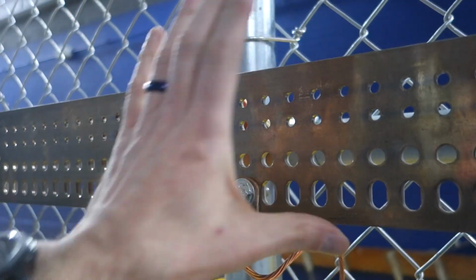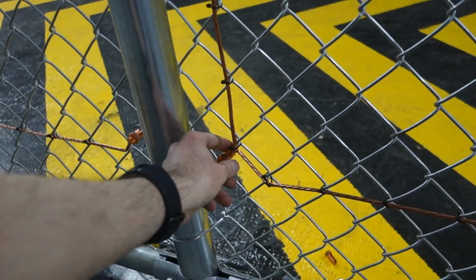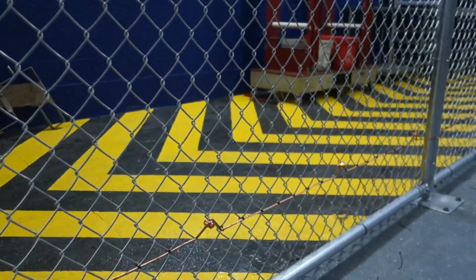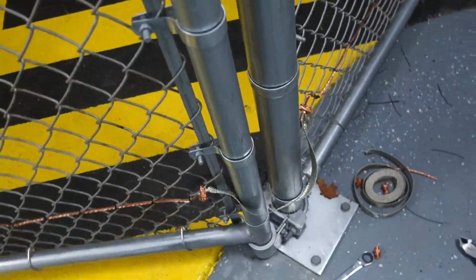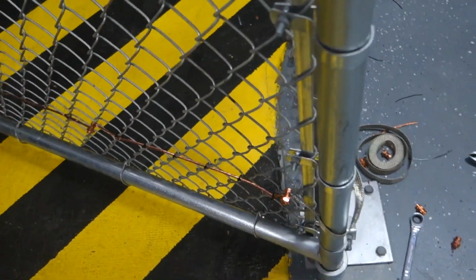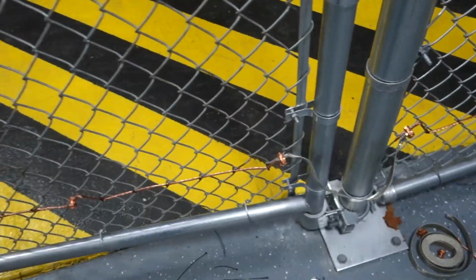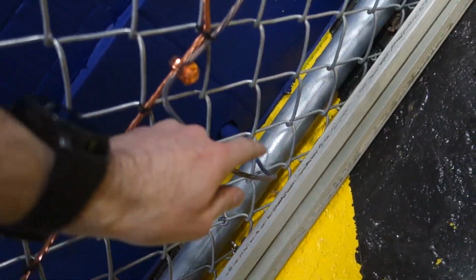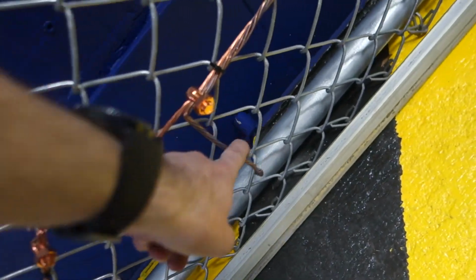So we've got this is the front and center ground plate, connected down, bonded here, bonds to the cage, bonds with these every 2 feet. And we jump over the thing, and we go down, and we go down, and this is gonna go up, over, and down, and then it's gonna tie in right here, and we got the bendy thing, yay! Look at that. Boom. Full extension on the gate and still a little bit of slack for safety. So that totally bonds the door, and then it goes over here, and then we connect. Boom, we go down to the ground wire outside to the actual ground rod, and we go over here. Boom, down to the next one.